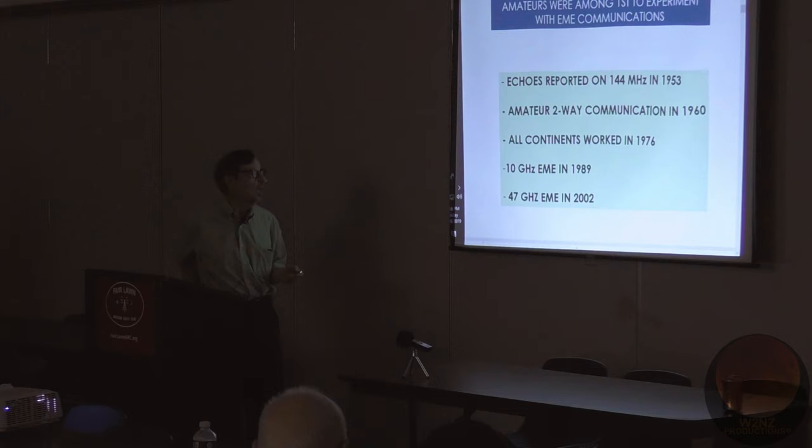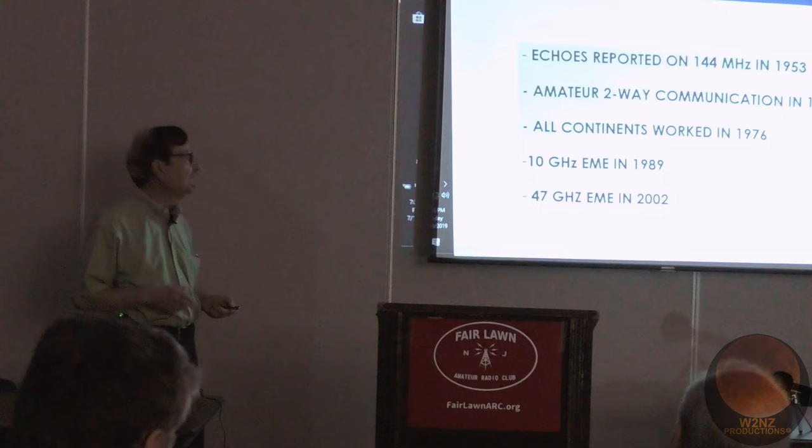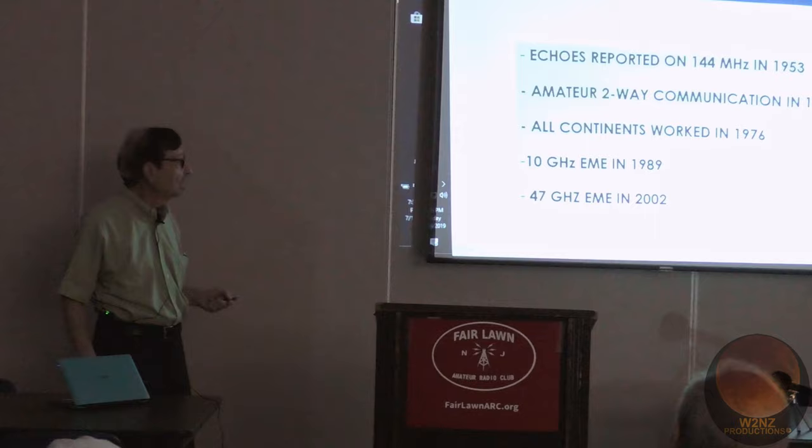It took a while for 10 gigahertz to get on. This is 3 centimeters, as we refer to it today. And that was in 1989. And in 2002, we had 47 gigahertz EME communications on. So we keep climbing the ladder, going to higher frequency. And people are right now working up very near to 80 gigahertz, getting echoes at 80 gigahertz. And they actually have heard echoes, but there hasn't been a two-way contact up at the 80 gigahertz band. Actually, I think it's 87 gigahertz. So that gives you an idea of what's happening in EME.